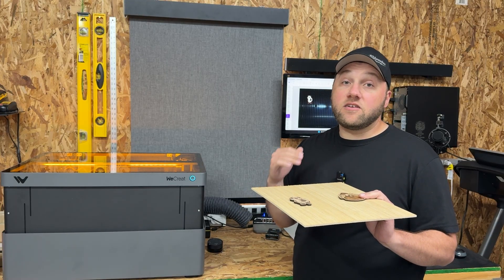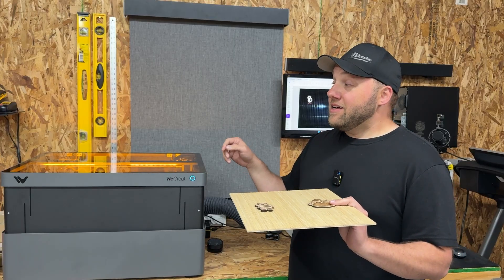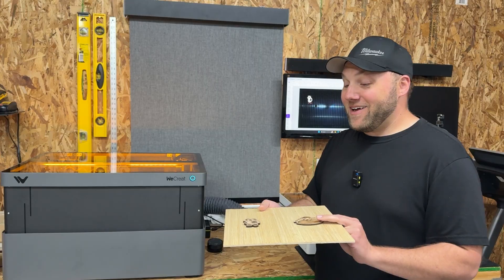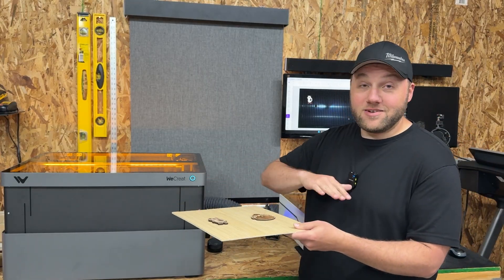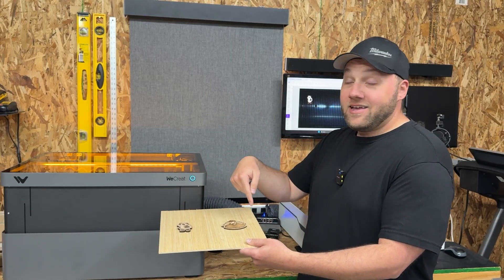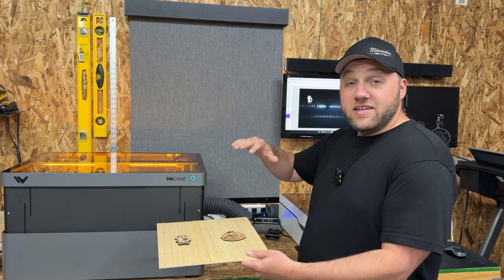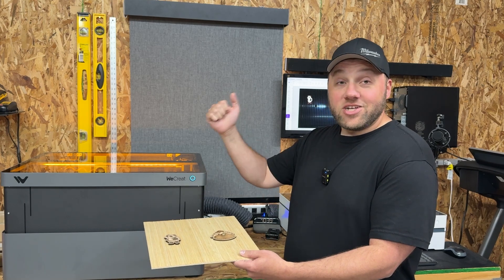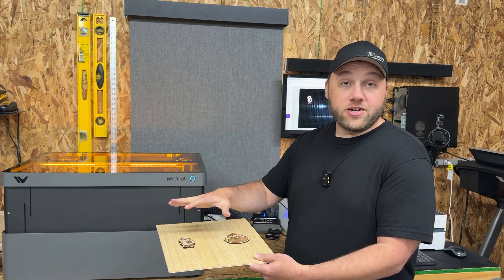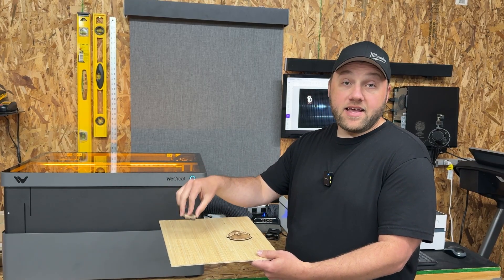Instinctively you want to pull this out of the machine right away, but if you're working with a new type of material and you don't know the settings and you've only got one shot — technically you've got two shots with this trick, or maybe even more. So let's say you put your blank material in, hit engrave, it engraves this panda and the other logo. What you want to do is: don't take it out of the machine, don't touch it. Just shine a flashlight down into your machine and see if the engraving looks dark enough.